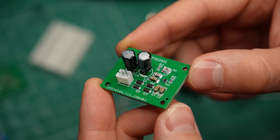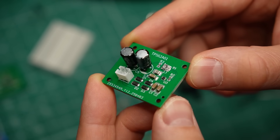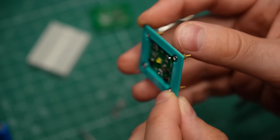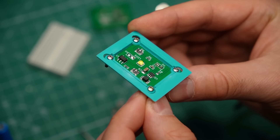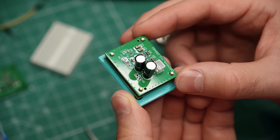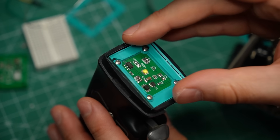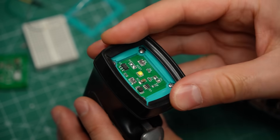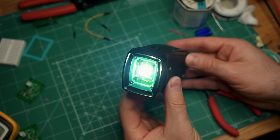After all the testing, I soldered the two small supercapacitors to one of the PCBs. For the other PCB, I 3D printed a holder piece so that it fits inside the flashlight. The two circuit boards go on top of each other and are held together by metal spacers in the corners. Then the glass cover and the bezel go in their places. And now I have a heavily modified, over-engineered supercapacitor flashlight.